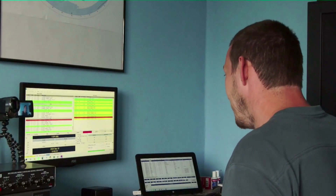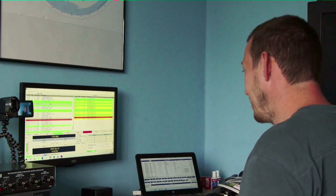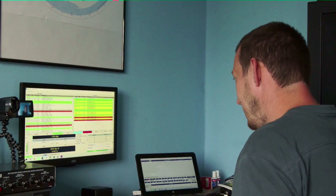We're all connected up, I've tuned up the antenna, and I've got FT8 on the go. It seems to be receiving — this might actually work. Oh wow, he heard me! This is hilarious — I'm talking to Germany on the shed. Let's log it. He's Delta Hotel 9 Delta X-ray Portable. I've sent him plus nine and he's sent me minus four. As receiving antennas go, this isn't all that bad. What signal strength is he giving me?